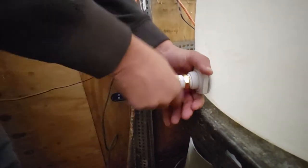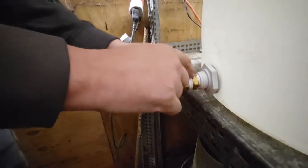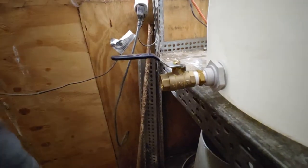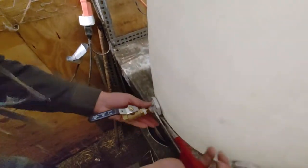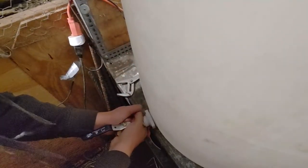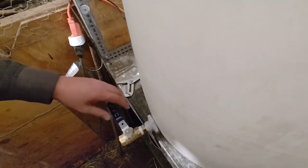I hate it when you screw a ball valve in or something and it's not perfectly straight, but this way I can get it straight. This is nice and tight and in, and then I can take my channel locks here, hold it right where I want it, and tight. And because this is reverse threaded, I can tighten the barrel up just snug right where I want it. Perfect. Great. That'll give me a lot more flow.